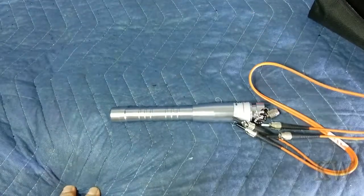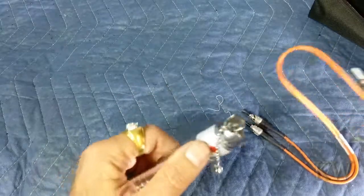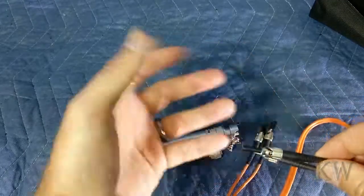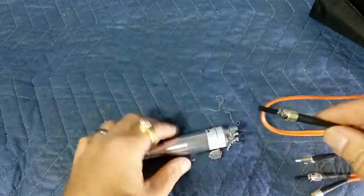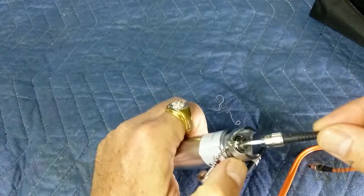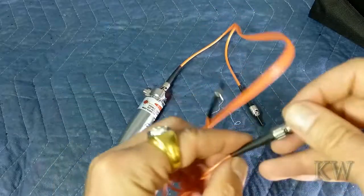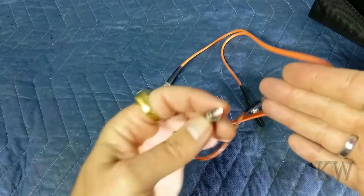So it's good to test these even straight out of the bag. I'll show you a little sample: take your fiber light, put it on the ST connector. If you have LC connectors you can put a barrel adapter on it — ST to ST — and test it that way. We've got an ST connector here; you just put it in the little hole like that. When you turn it on, you can see it's already glowing — quite a bright light.